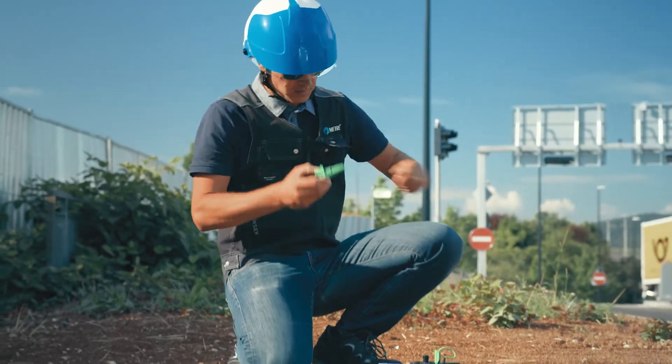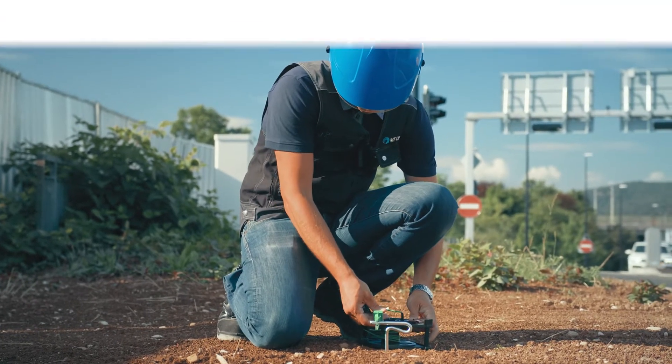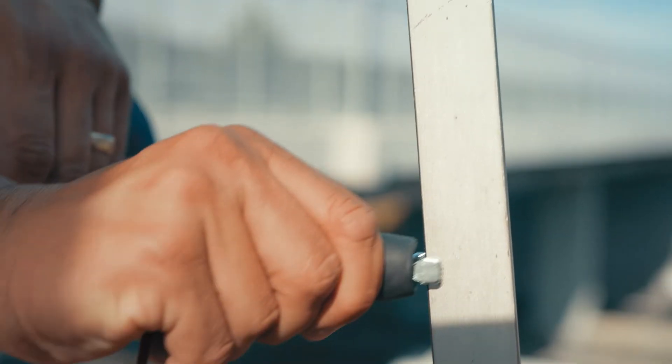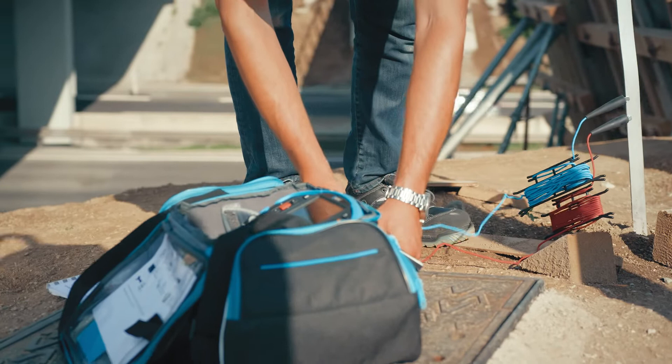The green test lead is connected to a voltage sensing probe, which is driven into appropriate soil — or should we say ground — far from the tested grounded street lamp. Test leads red and blue are connected to the grounding lead, while both the black and green leads must be sufficiently far from the tested grounded object.